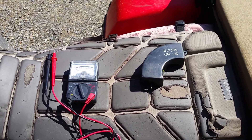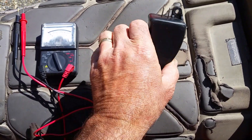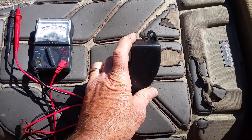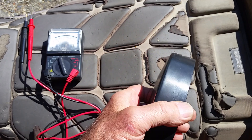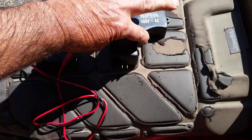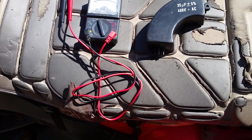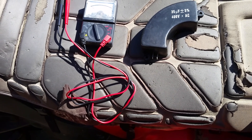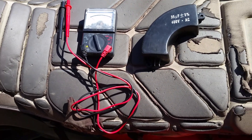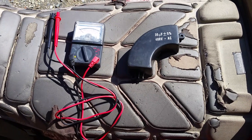So just to make sure it was bad, I did the old-school test. I went ahead and plugged it in for about a second and a half. All I had available was 120 volts — hooked it up for a second, it took some energy, then I disconnected it, waited a minute or two, and shorted across the two terminals. It did discharge with a fine blue spark, so I thought the cap was good and something was wrong with my meter test.